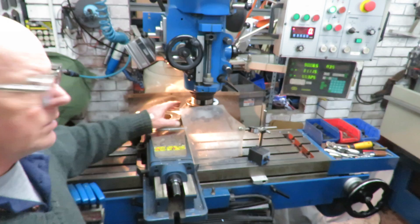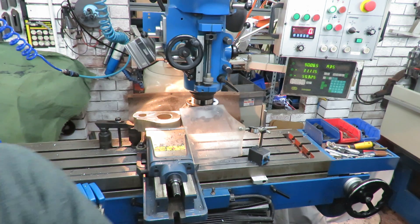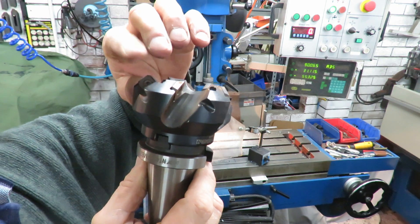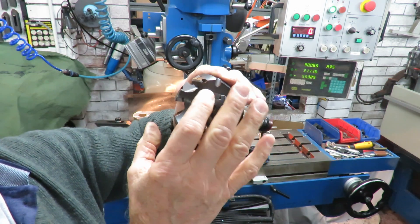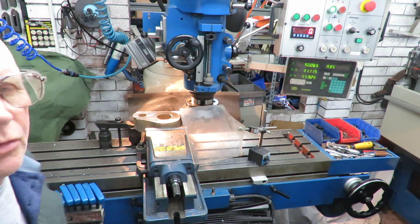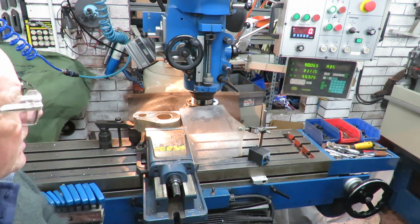So now we're using the large cutter head that I've got, which is similar to this cutter head. It cuts at 90 degrees — square blocks — so they have very low power requirements but high removal rates. This one's 100mm and the one on there is 160mm, which is just over 6 inches. I'm running it at about 700rpm and at about 22% of the feed rate — I don't know what that exact feed rate is, but whatever it is, it is. And I'm taking cuts of about 0.3 to 0.4mm each time.